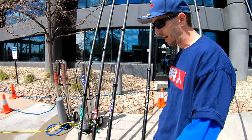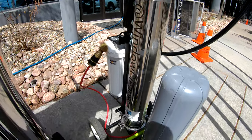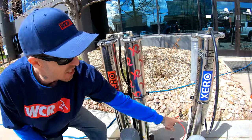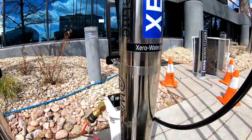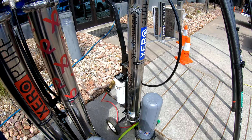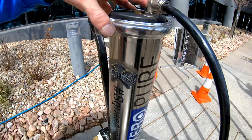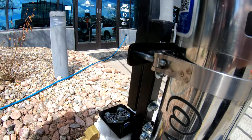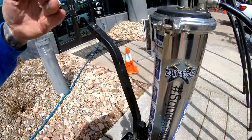Let's talk about some filtration devices. The Xero Pure Cart — eight years now, it's the number one selling water-fed cart on the market. It's a three-stage cart with your standard 3.5x10 carbon sediment filter, a 4x40 inch RO membrane in a stainless steel housing. No cheap plastic fittings — this is a very high-quality cart. The clamps, mounting hardware, wheels, axle — everything about this cart screams quality.